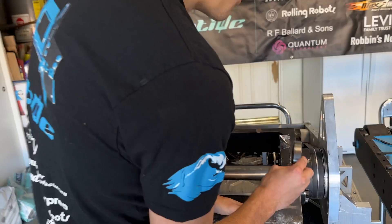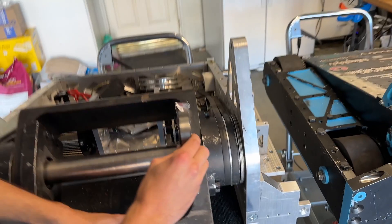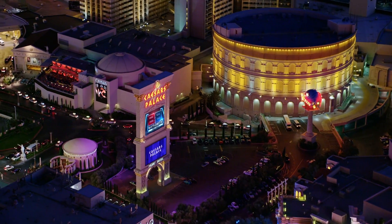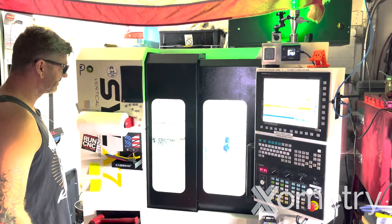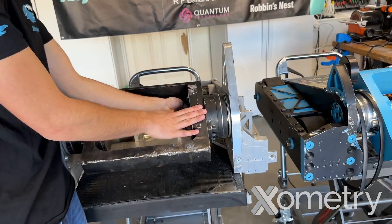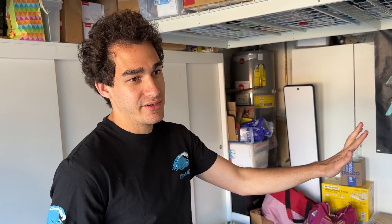We switched to four cylindrical roller bearings, placing them inside the weapon bar. Being in the middle of Vegas with no machinists around, our sponsor Xometry really stepped in — they had a network of machinists in Vegas we could take advantage of in a tight pinch. We needed a cap made, and even though we couldn't do a thicker shaft, the new setup already had a higher load rating than before.